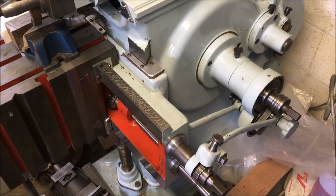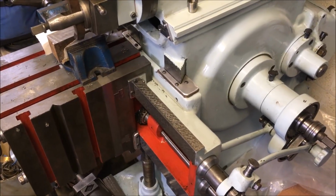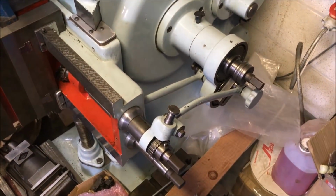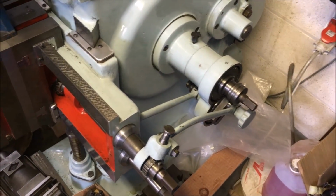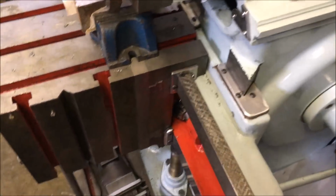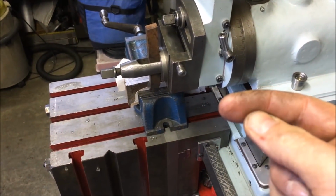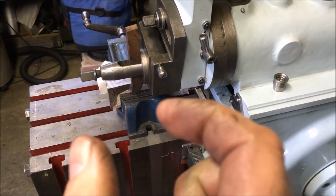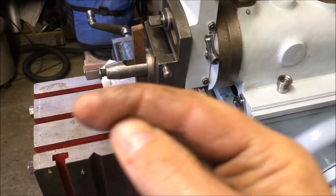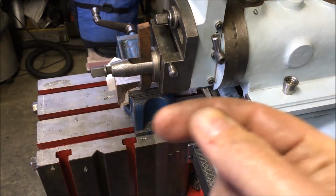So before I start chewing off the steel on that two-block for squaring up, I thought I'd set the timing on the index feed. If you remember on an earlier episode, if it made the editor's cut, whilst the feed was in the right orientation, it was very borderline close to the position at which the ram starts to reverse and come back. So I think some of the feed was happening before the end of the stroke,